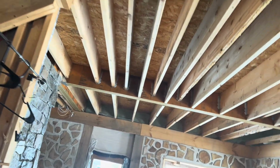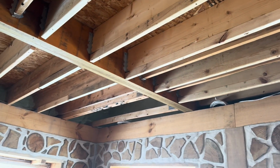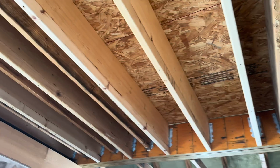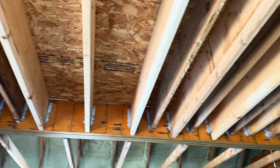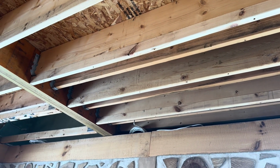But anyhow, me and my wife are going to go cut some tamarack trees to create fake beams in our ceiling. So we've furred down the ceiling. We added these strips to the bottom so everything is level. And if you're asking why there's so many floor joists, it's because my workout equipment will be upstairs, so I wanted the extra strength. My Smith machine legs will be there and there, so it'll straddle that one section. But I didn't need to fur down all of them, just every other where the joist would normally be.